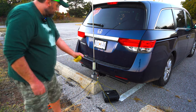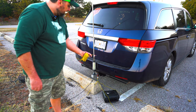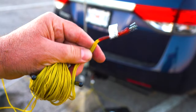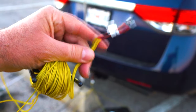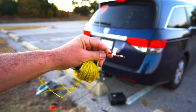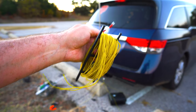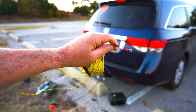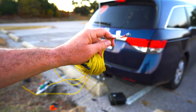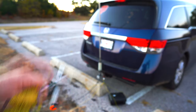And I made more radials — these are for 40 meters. I did the same thing. I connected four radials, and I also marked it here so I wouldn't forget in six months. This spade-type connector connects right into there. And this is four radials at 33 feet each. Probably a little overkill, but that should work for 40 meters. That's a quarter wave — 33 feet is about a quarter wave.